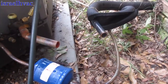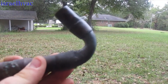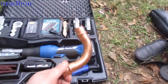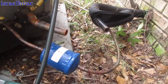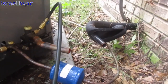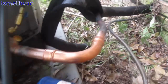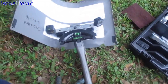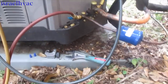Alright guys, I've got it cut out of there — yeah, that's definitely not a 90° anymore. We're going to use a Zoomlock 90° to replace it. I'll prep my tubing, sand it, deburr it, and get it ready. I've got the Zoomlock 90° in place — had to get the tube bender involved a little bit too. Just because you have a Zoomlock doesn't mean you give up your bender. Had to make a little bend right there to make it fit, and now we're going to lock everything in place.